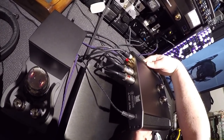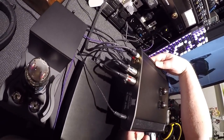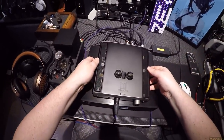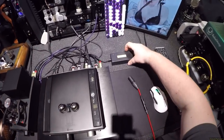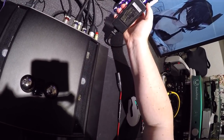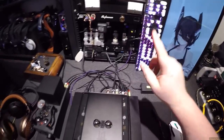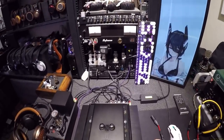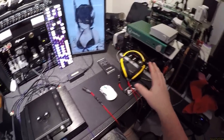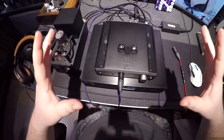So we've got single-ended in and loop out, literally an arrow. It's very cool. You get your balanced XLR inputs, and you get an input transformer. That's it for the back of it. Here's your input transformer. It is running moderately warm, 36 volt, 1.4 amp. And I wrote Liquid Platinum on it with my label maker. Zeos, future Zeos, link to that Dymo label maker. It's a lifesaver. Label all your transformers, especially in my line of work. You need to know where the hell that's from when it falls on the floor.